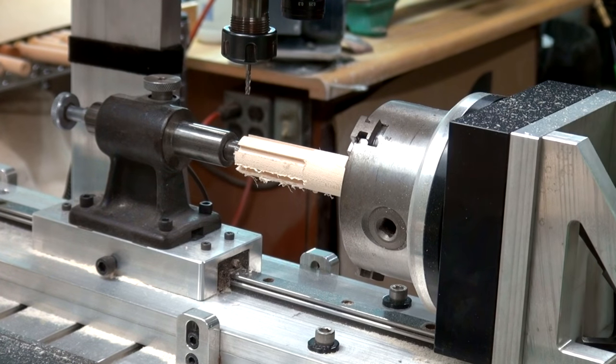Okay, I'll skip the finish pass. I'll leave that at 177. I'll put that feed rate down to 30. So basically, I'll be running the same program without the roughing cut. It'll just go in and take just the one pass at the same setting. In fact, I'll bump that a couple of tenths. 3/10.